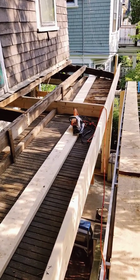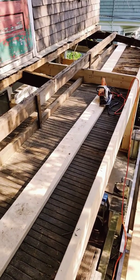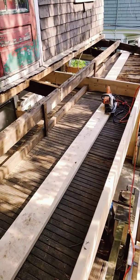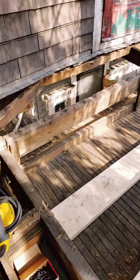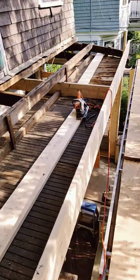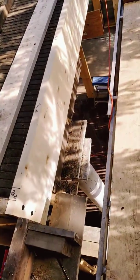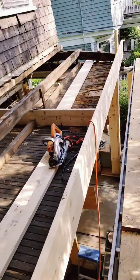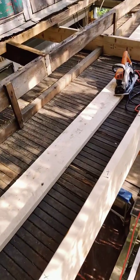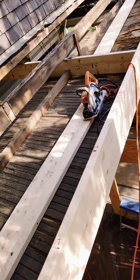The plan is to remove the remaining beadboard ceiling, which is below these yellow planks and the inside where my orange saw is. I'm going to cut everything out here. The only thing that's going to be left is this beam that goes 24 feet and holds up what's left of the roof. This post holds what's been framed or what will be left. This post, which is a strongback, holds what's left to that side in addition to supporting this new 2x12 18-foot-long beam.